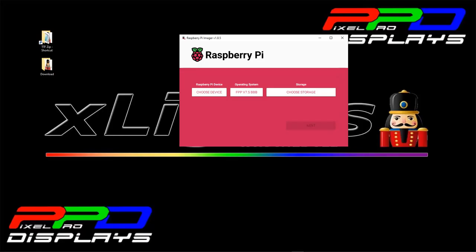Now, do I remember this right with the BeagleBone, that you have to push and hold down the button underneath it for the first boot up? It depends on when the Beagle was manufactured. If it was manufactured in the last 4 years, then you don't. It doesn't hurt to hold the S2 button down because it forces the issue. Well, let's try it without. We can try it both ways. So it's no loss here.